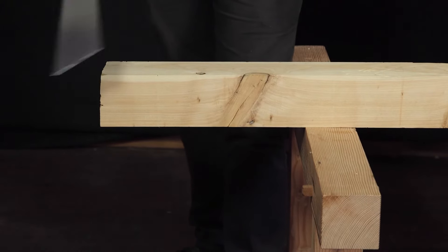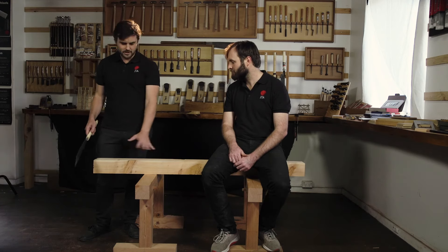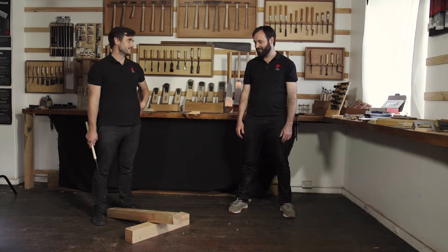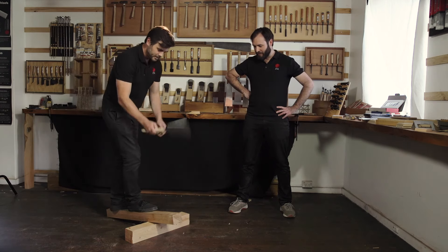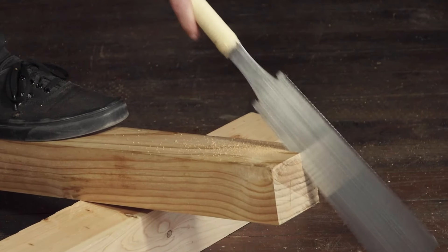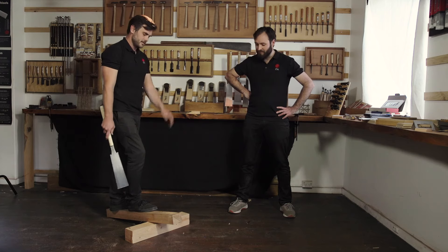That's one option. The other way, if we're going to do a rip, would just be a matter of me getting down low and starting to cut like this. That's all well and good when you're working with a big piece of material, but sometimes you might be working with something a lot shorter and you won't be able to get it as secure. So I'll show you how a Japanese carpenter deals with that. This is the most basic setup, but it gets used quite a bit, and it's really the best way to rip wood. I've just got a block and I've placed the piece on top and I use my own body weight. Need a bit of balance, and then you make the cut. You don't really need to apply any pressure to the blade, but that posture allows you to really use your abdominal muscles to make the cut, making it so much easier and less tiring than any other position.